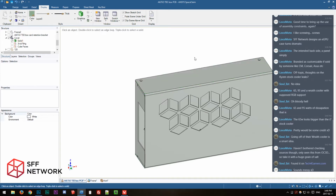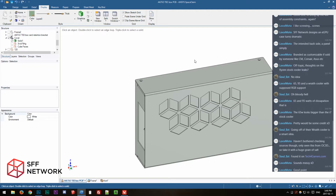In this particular case, it's not going to be too big a deal because it's a fairly straightforward part. But it would be very bad design to have a critical component with a bunch of features, like a flange or a hole or a nut or a mounting stud or a cutout or anything, that are almost symmetric. That's a horrible idea, because during both manufacturing and assembly, either at the factory or the end user has to pay extra close attention to whether it's in the correct orientation. And if it's only very slightly off symmetric and it's hard to tell which orientation is which, that's bad design. So generally, you either want it to be symmetric or you want it to be very not symmetric, so it's very obvious which orientation the part should be.